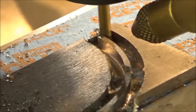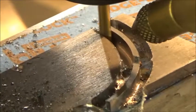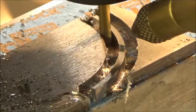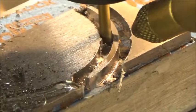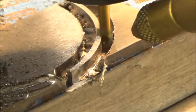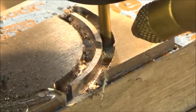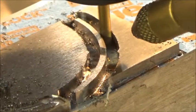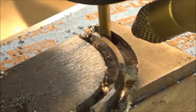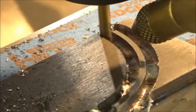Beautiful! I'm down 125 thousandths, I'm going to 127. I should be hitting the tape now, and I am. So I'm going to go 2 thousandths beyond this. Also, it's cutting the tabs — doing a beautiful job cutting the tabs. So we're going to have the tabs hold, which they should. Theoretically they should be about 4 thousandths.